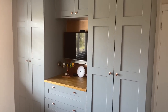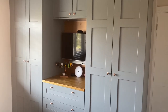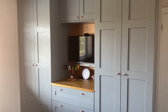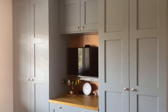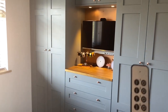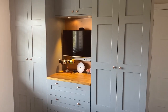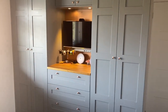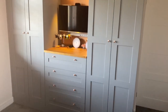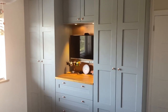What I did was paint all the boards two coats of primer before I started cutting them - painting full sheets on my drive with two coats of Zinsser 1-2-3. Then I built it all up in the empty room. Another feature was the lighting - I put some spotlights that work off a remote I bought from Amazon. A lot of my wardrobes have lights at the top and bottom like plinth lights. I always use a remote since I'm not an electrician.